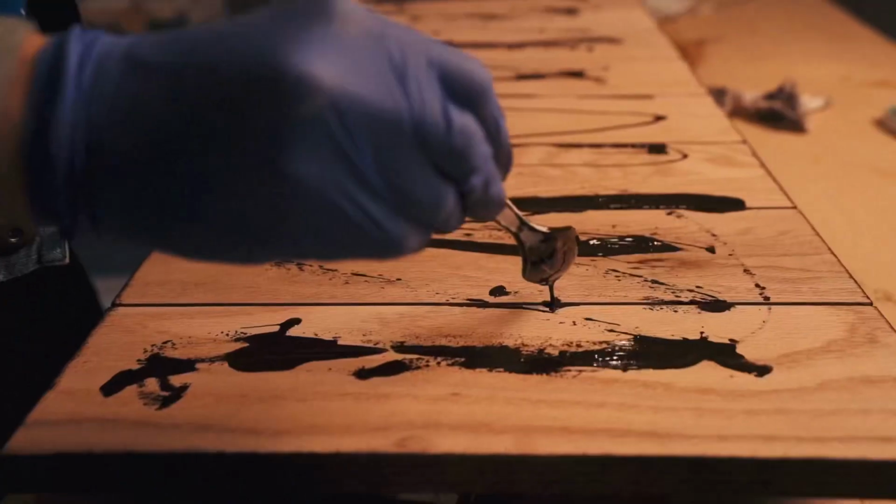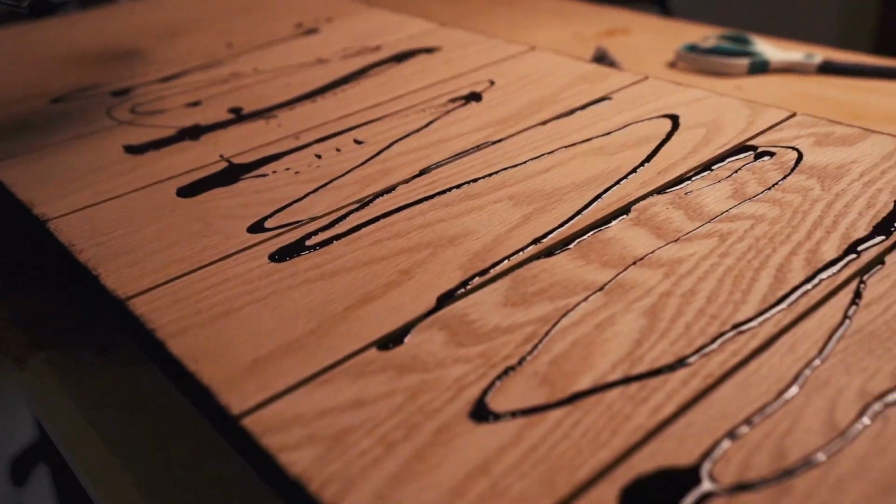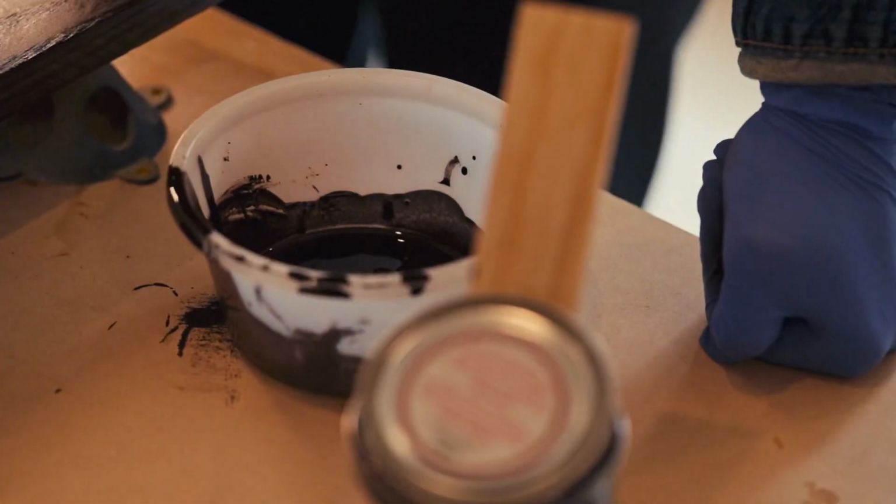In the past, when I stained my stair treads, I had to use various methods of timing how long the stain sits on the wood and how long I wait before another coat. That's a major contrast to Rubio, where it's only one coat, wipe on, and buff out. It's just as simple as that.